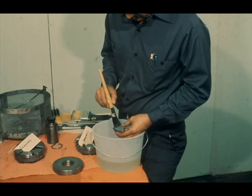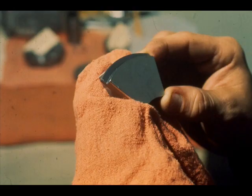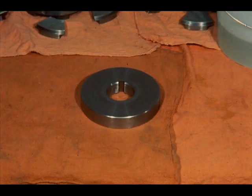All of the bearing components should be cleaned thoroughly and inspected for wear or damage. Particular attention should be given to the thrust shoes and the thrust collar. For instance, the original scraper marks should be visible in the Babbitt face of the thrust shoes. If they are not visible, it may indicate a need for installing new shoes. If you are in doubt, ask your supervisor. By the same token, if a definite wear pattern is visible on the bearing surfaces of the thrust collar, it would indicate that there may be overloading, improper lubrication, or metal fragments embedded in the thrust shoe Babbitt surfaces. Again, if in doubt, ask your supervisor.